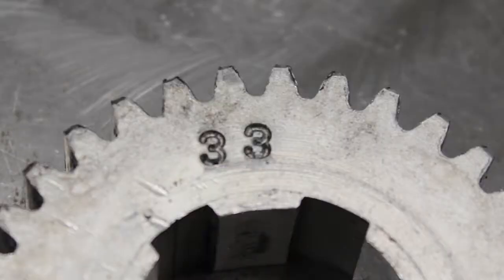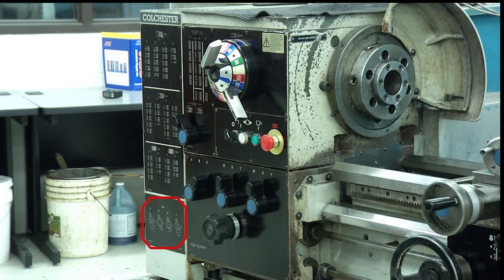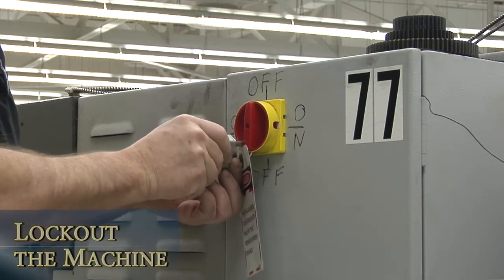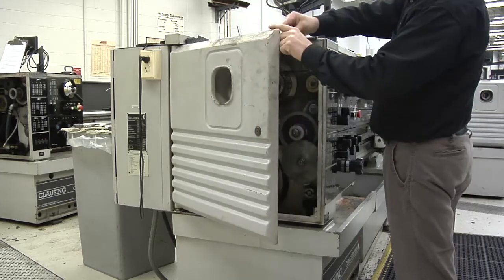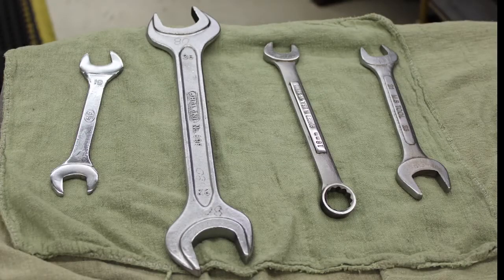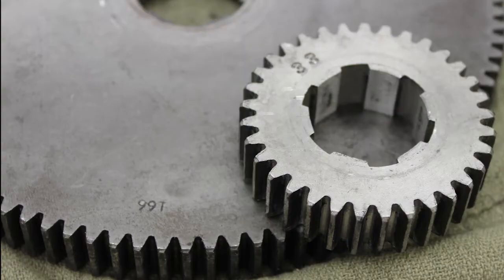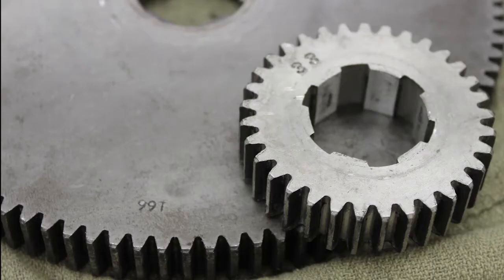The number of gear teeth, which is stamped on the gear, determines change gears. Change gear configurations and the corresponding feed and thread pitches are found in the data plates at the front of the headstock. To change gears, begin by properly locking out the electricity to the machine. Open the end guard door. Determine the proper wrench assortment — this is a metric machine, so only use metric wrenches. Adjustable wrenches should never be used. Look at the data plate and establish which gear combination is needed. Collect the needed gears; some may remain on the machine. Thoroughly inspect and clean each one.